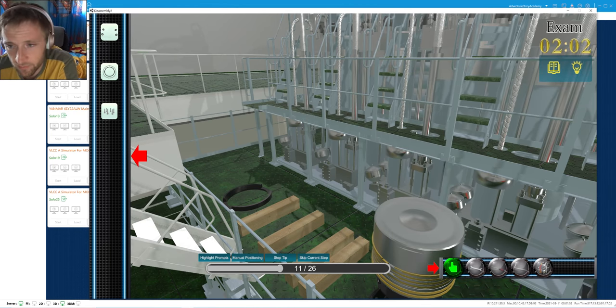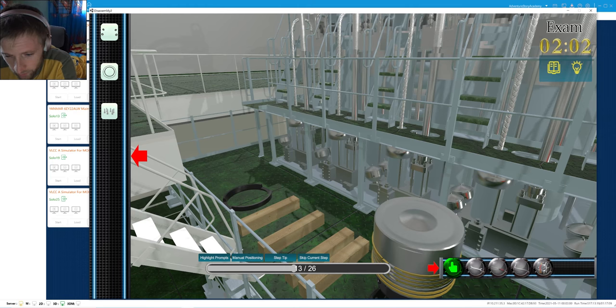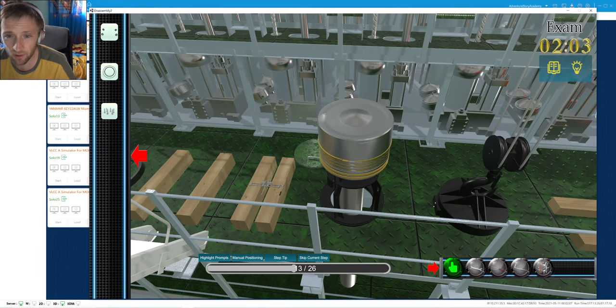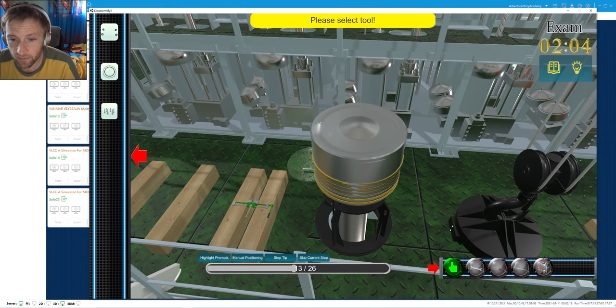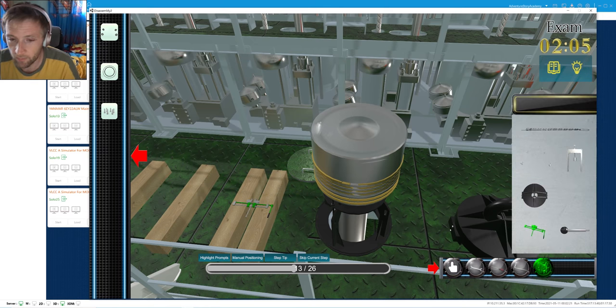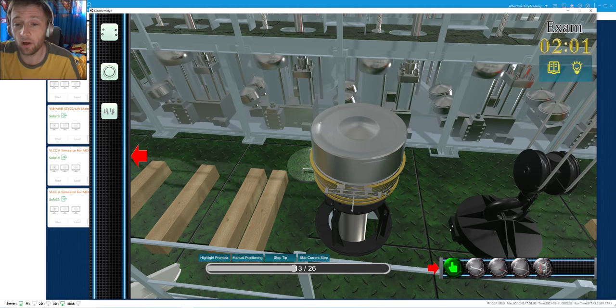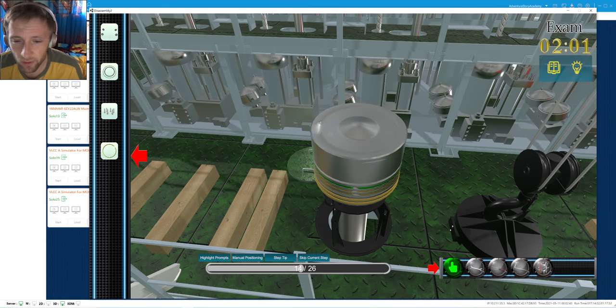The crane will pick up all things. Now we are turning all the piston rings to the same position. We take the expander - pressing and selecting it. This must be done very carefully. You must never get your hands anywhere around or between the piston and the ring - it is really dangerous and can damage your hands, as the piston ring tension is really strong.